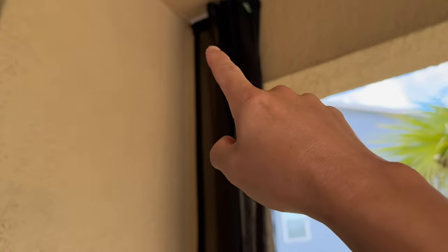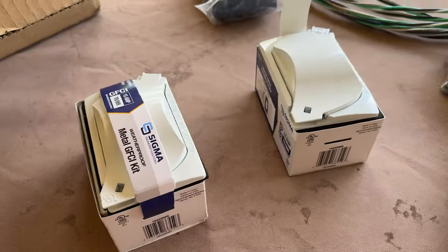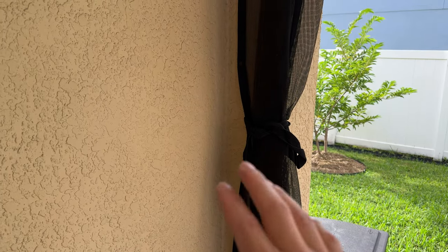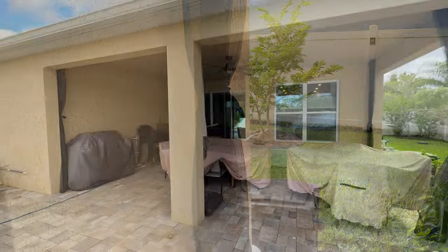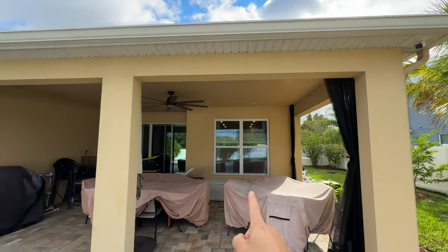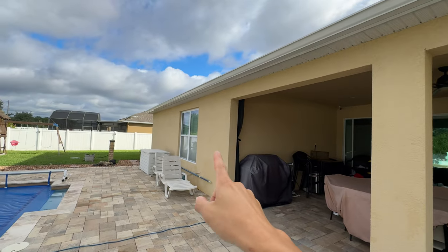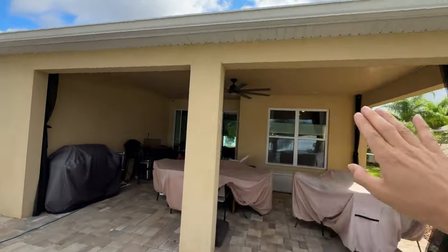In addition, on the backside here I'm going to pull a conduit from that corner all the way down here and put an outdoor box right here for a switch just for override and manual control of these lights out here. I'm going to have it in a weatherproof cover since we are on an outdoor patio. I'm not going to put as many lights in the back here as I did up front. I'm basically going to have one light right here in the center, one right there, one lining up with the window, and one on that blank wall - so four in the back.